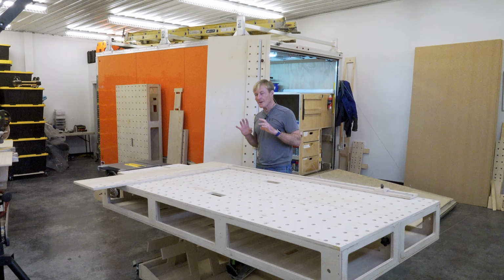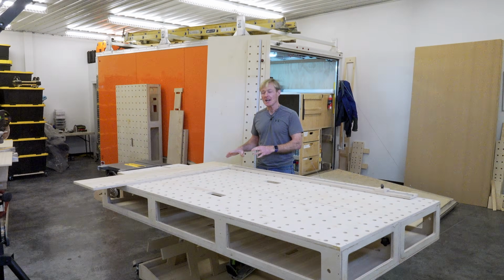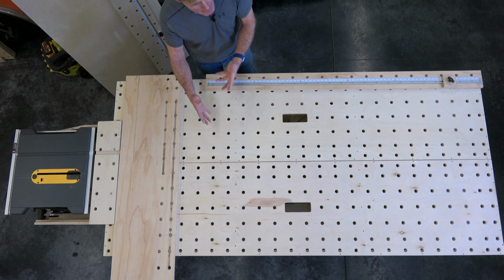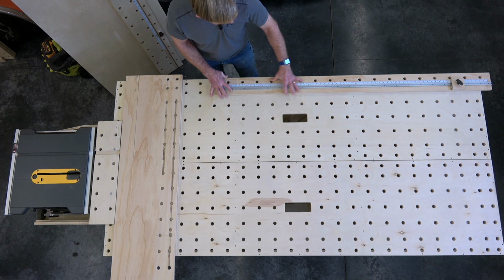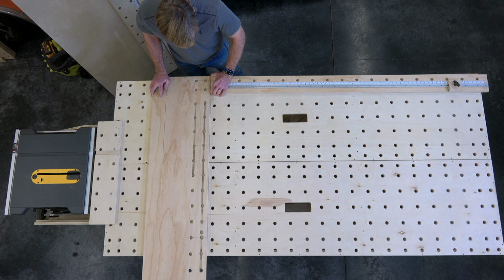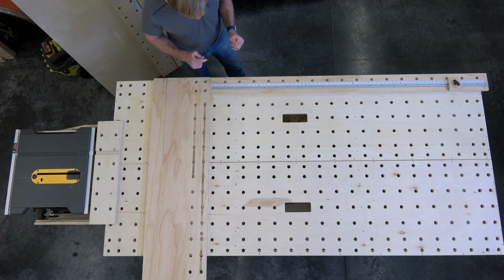The Smart Crosscut was a major evolution from the original Paulk Crosscut jig. This was a lot simpler, a lot easier to set up, and particularly much easier to calibrate because the square calibration was automatic, being used on any of the Paulk workbenches, and in fact on any MFT table with the 20mm holes, 96mm spacing, which is industry standard worldwide. So I could just attach one portion with bench dogs and then the cross-cutting section with bench dogs, and by butting them next to each other, the rail for the length was precisely calibrated, and there was a calibration screw for that fine adjustment.